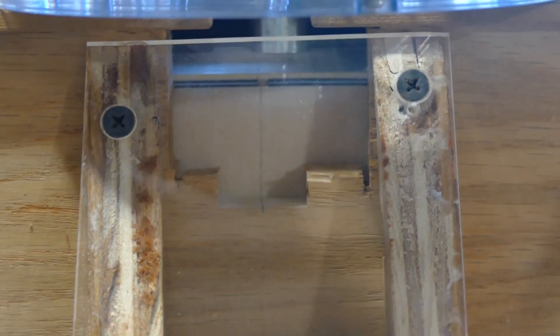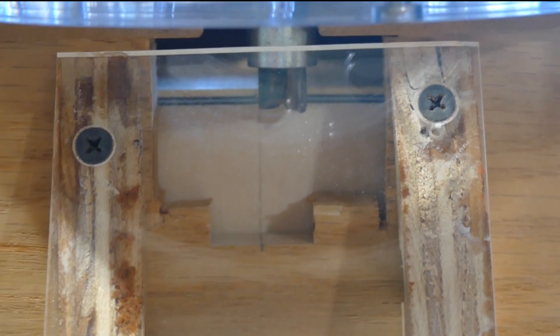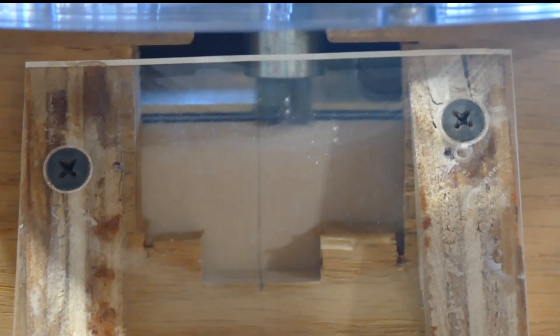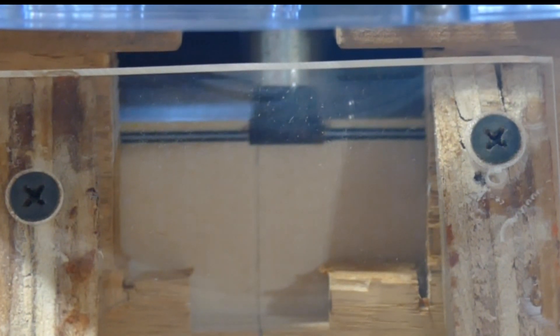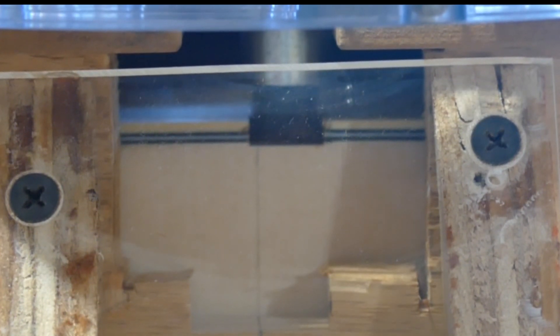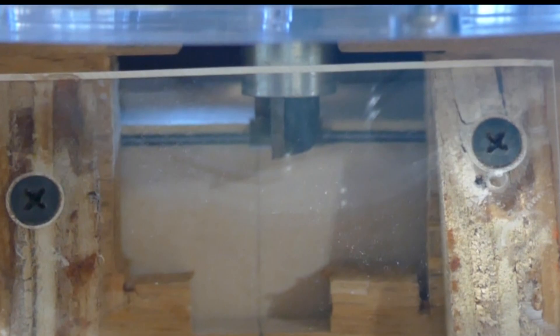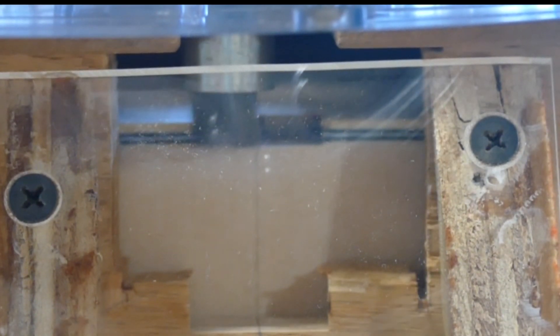For the first pass, I lower the bit to just past the binding and purfling scheme. I first want to clear the binding and purfling on both sides, and it's best to remove them from the top down. I don't do a full pass here because on the other side I would be coming up behind the binding and purfling, which can pop it out of place. Instead I stop the router after clearing the binding on one side, then reset on the other side to safely remove the binding and purfling, again from the top down.